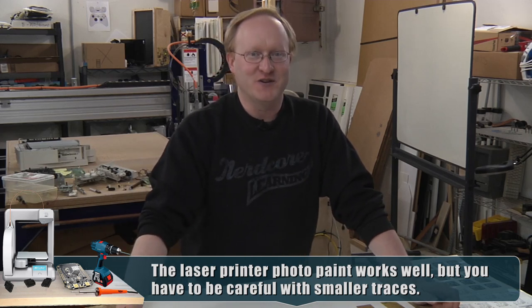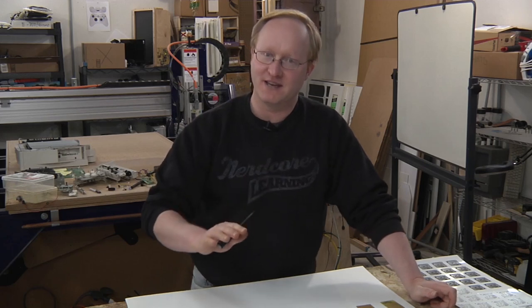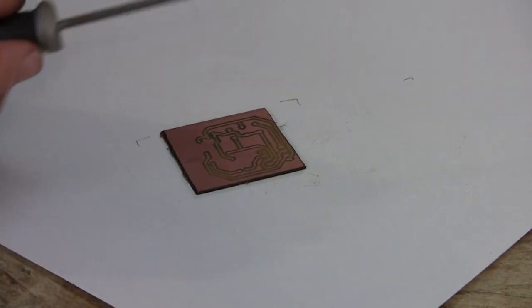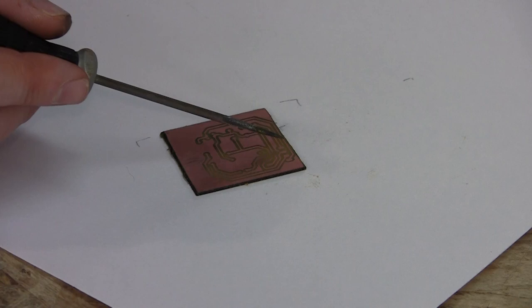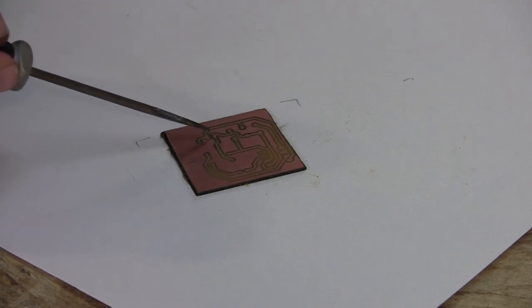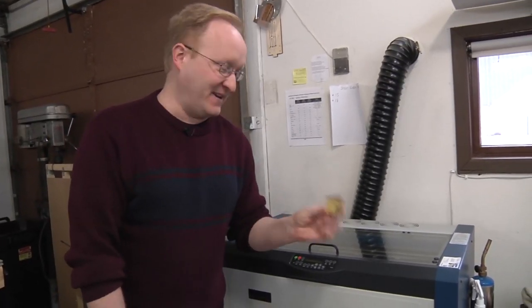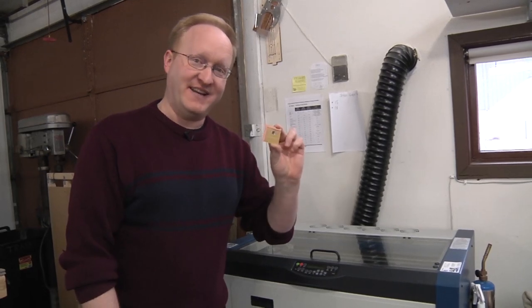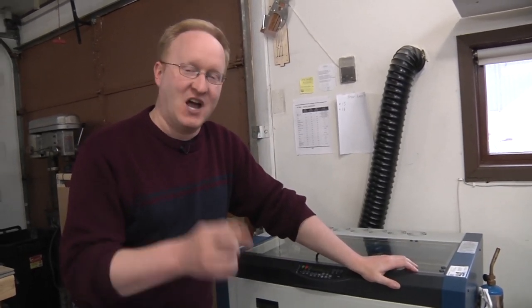Something else we could possibly do is put on a layer of clear enamel after etching, then stick it back in the laser and use the laser to burn away the enamel to create a solder mask layer — it wouldn't be perfect, but it might be functional. This is the timer circuit again and it turned out really nice — the edges are clean, the fill is great, and the pads are pretty much exactly as they were exported. I was quite impressed with it. This laser cutter can do anything — check out this PCB, and we used the same method in the previous episode to make the button matrix for the Dave Jones CNC. Our next episode will use it again when we make some high-powered two-way radio chat devices. We'll see you then.